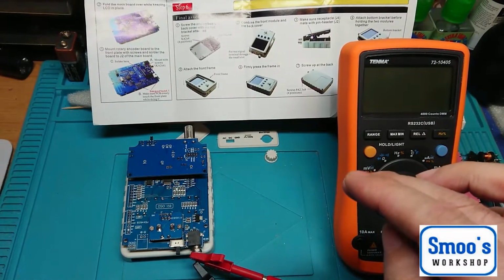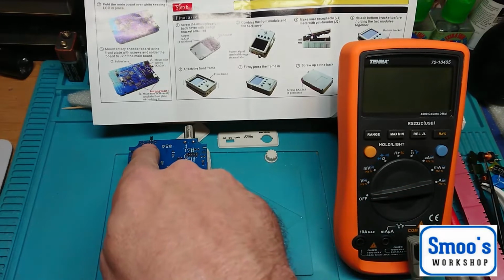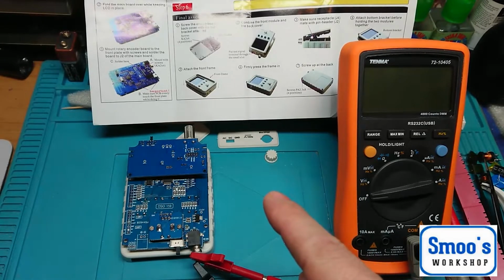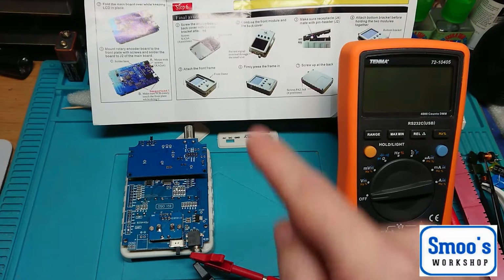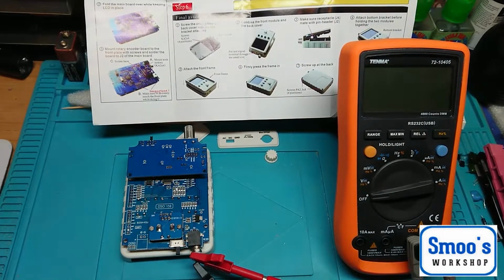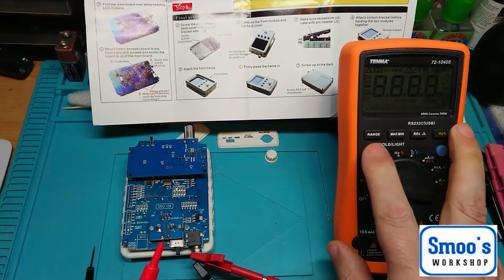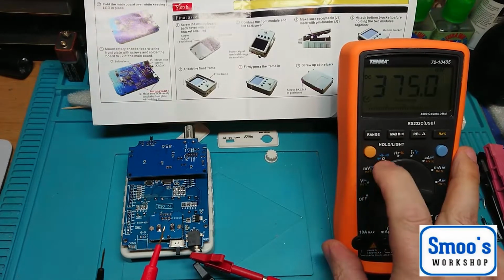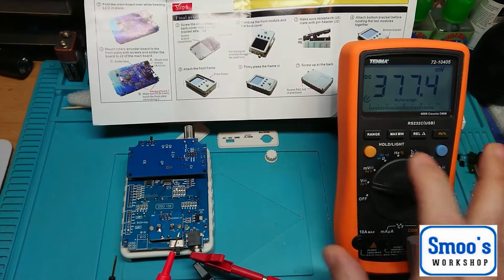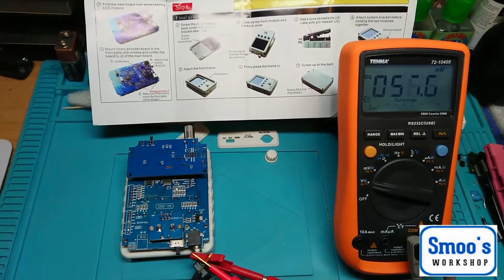And then it says set the couple switch to ground position. So that's that wee switch at the top, that's on ground position. And check voltages at the points shown in the photo. Okay, so let's have a go at that. Right, I'm just going to get my meter out. So first thing I'm going to check is, let's get my meter on here. I'll turn my backlight on so you can see what we're on about. Hopefully that'll show up. Right, zero them out.